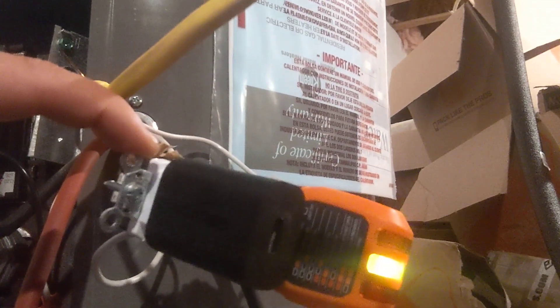I could not find anybody online who had actually completed this system — actually hooked up a 48-volt DC element to a water heater — and it works just fine. It's going to bring our propane usage for hot water to zero. Real simple: I've got power coming in from outside, hitting my thermostat in and then out. The out goes to my switch — basically a regular 110V outlet that is powered when the thermostat is on, and that outlet powers a relay to switch the 48 volts.